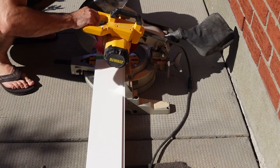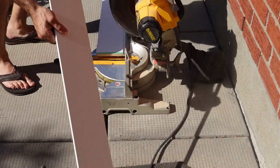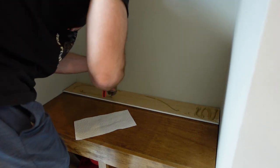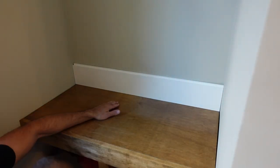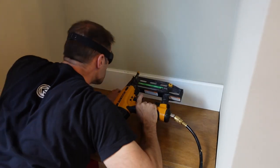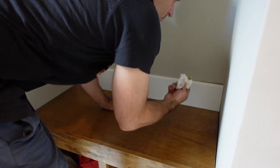After that, I'm going to do the shiplap. Everything is around that 36-inch mark. I used tape on the shiplap boards so they don't get chipped, because they're pre-painted. I have some ceiling flat paint to touch up anywhere they did get split, but any touch-up was very minor. Using construction adhesive again, I shoot nails through the top of the boards only — almost like a tongue-and-groove system — so you don't see the nails at all. That back corner dips a bit, so I use construction adhesive there so it'll be solid once dry.